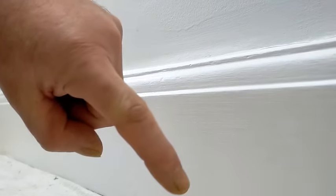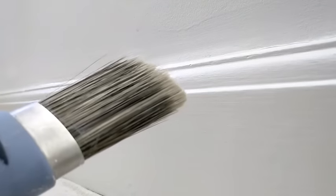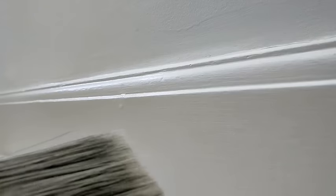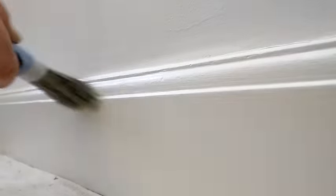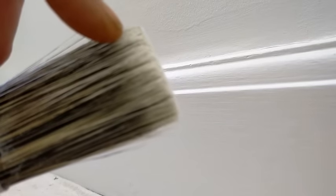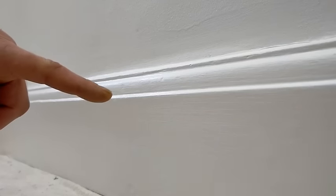This is now touch dry, but that drip is still wet. With my brush — I've washed it out, it's damp, I've spun it but it's still damp — don't use a dry brush, just rub that drip out. Then go and wash your brush quickly because this will dry hard. No problem — that's gone.